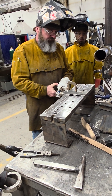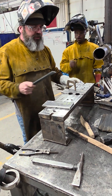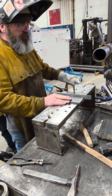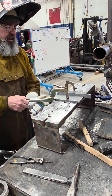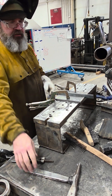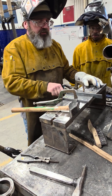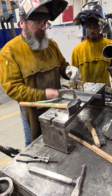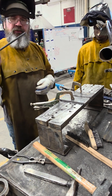I'm going to use the backing strip to set the quarter-inch gap, so I'm not worried about how tight it is right now. I want to get it clamped first, then tighten it up. I don't want a bunch of slop in it because that's going to be too wide. Just lightly tap it, feel that it's nice and tight, then pop it out gently. Then pop the backing strip in with the ground side down.